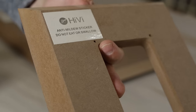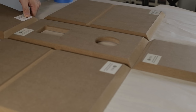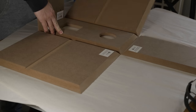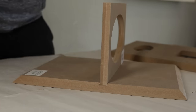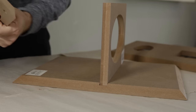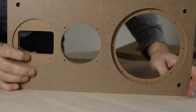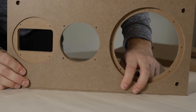If you choose to build this, there's one thing you absolutely must not forget: when lining this out, you've always got to figure out what the top and bottom is. If you put this the wrong way, the brace is going to go right through the midrange — that's not good. Flip it around. This brace should be lined up right between the woofer and the midrange.